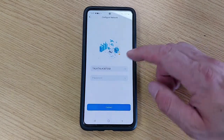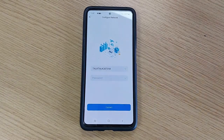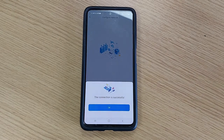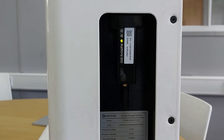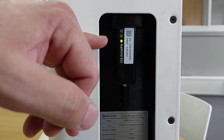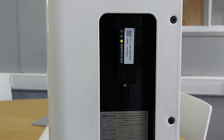The network may already be automatically picked up, but you're looking for the local network of the customer's house — simply click on the option at the top. In the password section below, enter the password for the modem and then press 'Connect.' What you're looking for is a message saying the connection is successful. Also check the dongle and make sure the LED light has gone solid — this confirms full connection. The LED should be solid with an impulse flash every 10 seconds. If it's constantly flashing, repeat the pairing process as it has been unsuccessful.